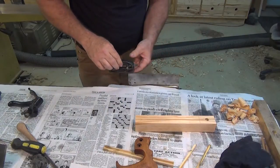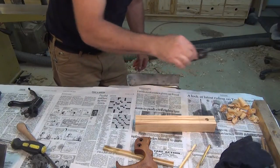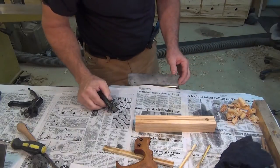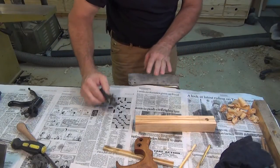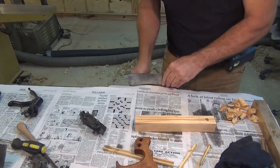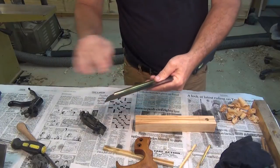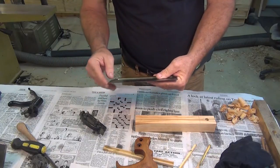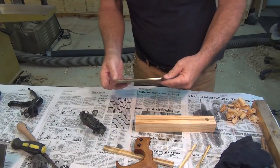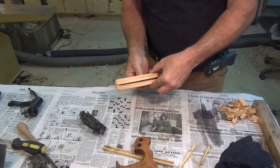And you'll simply put the jointer over the saw and just give it a few light passes. You're not trying to do a whole lot. You just want to give it one more. All you want to do is put a flat spot on the top of each tooth. That levels the teeth, and then as you file, when the flat spot goes away and becomes a point, you have a sharp tooth. So now, having done that, I'm going to turn it around and put it in the saw chock. Let it stick up.